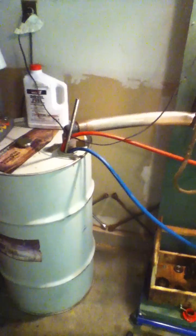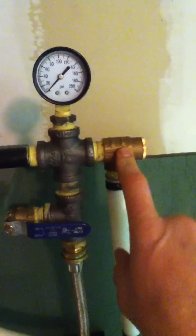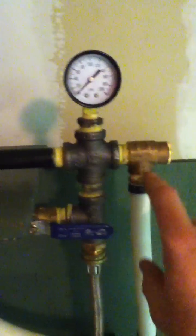The setup is as you see it right now. The blue hose is suction going in, the silver hose goes out to an oil manifold with a bypass, and the red hose goes right back to the tank. I have a pressure relief valve and a gauge. I'm going to get it started so you can see what's going on.